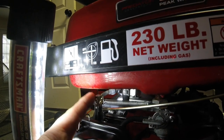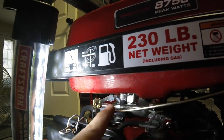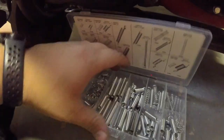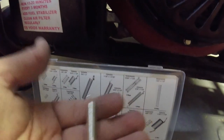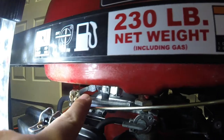That way you can use this retainer included in the package with the solenoid. The retainer includes two screws to attach to the rod, and it actually worked out perfectly where one of the screws can capture the end of the spring. The spring I ended up using is from the Harbor Freight kit — this one right here. I didn't have to stretch it, and it's not forcing the solenoid to bend outward. It's pretty well stretched and doesn't put too much tension.